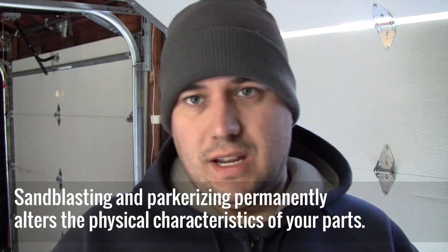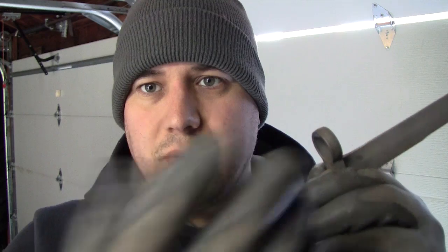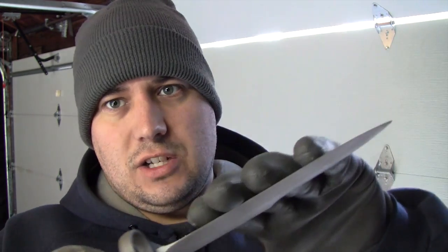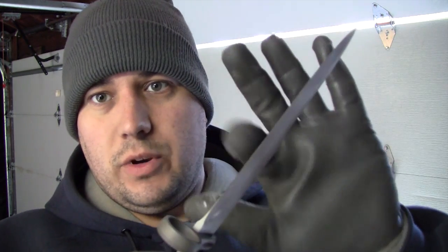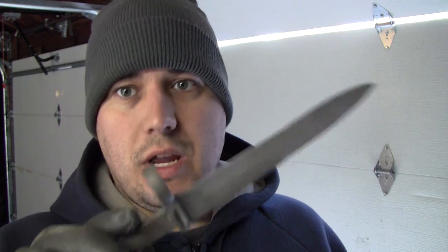Now the other thing worth mentioning is I'm not going to touch this with my bare fingers. I'm wearing rubber gloves right now, and they're clean, or they were cleaned. I'm not going to touch that with bare fingers because your oily hands have salt in them. You touch it and then it sticks to it, and right where you touch that knife is where it's going to rust, because those salts will attract moisture, and then the moisture will be sitting on top of the blade where you touched it. It's pretty dry right now, so I'm not really worried about flash rusting, though it could. So I kind of have to hurry up and drop this thing into the phosphate bath.